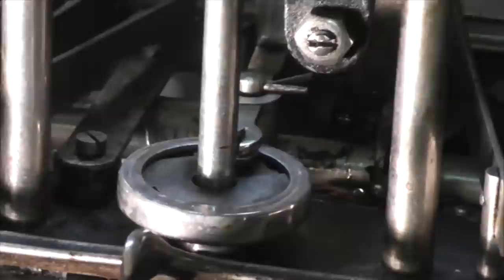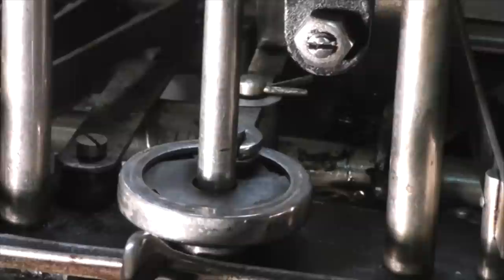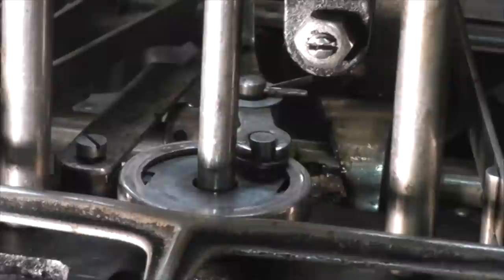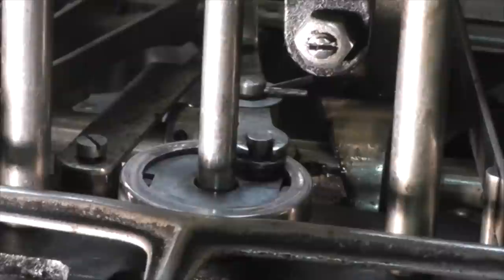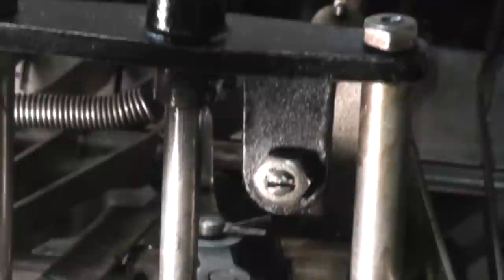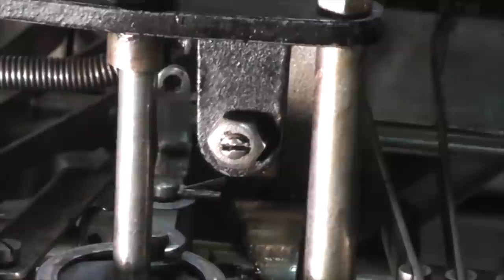We'll go ahead and cycle it one more time so you can see it again. So I stopped the wheel manually, so if I turn it counterclockwise, you can see how it's engaging that ratchet, but when it spins clockwise, it just spins free. And there's a spring right there, which provides the energy to spin the wheel, to move that gear, that ratchet.